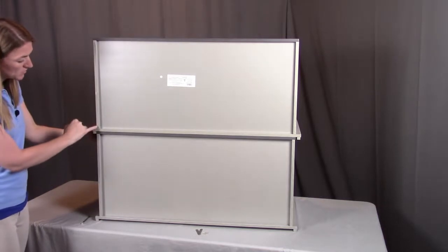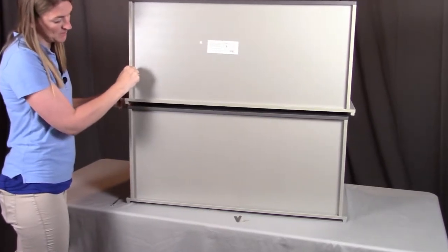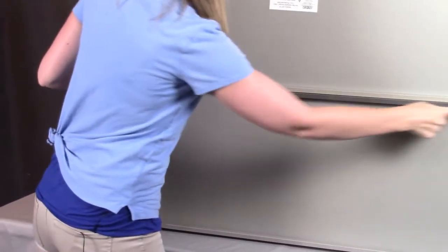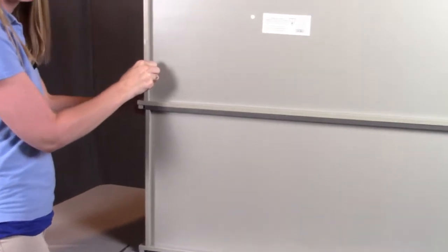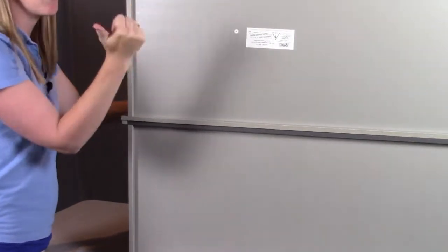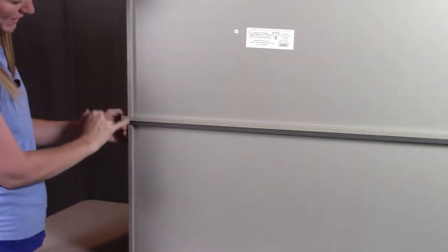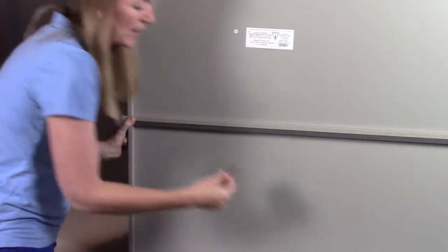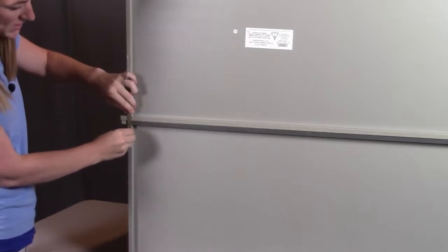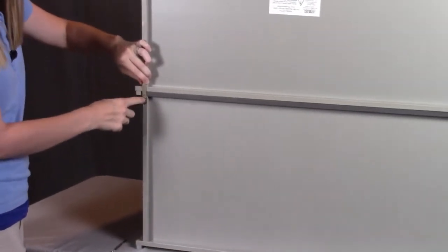You'll want to find these two little holes in the back — one on the top cubby and one on the bottom cubby. When you put the top cubby on, it's important to have these brackets to the outside of the upper edge so it can't go left or right. Also, pull this cubby back as far as you can because there's a lip in the front that will keep it from going back too far. When it's back as far as it can go and centered, put those brackets into place. The metal brackets should align with the hole on the top cubby and the hole on the bottom cubby, and we'll put small screws into the very top hole and the very bottom hole to hold the metal brackets into place.